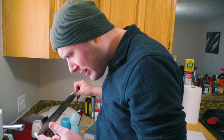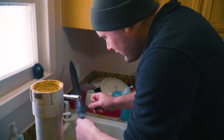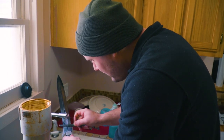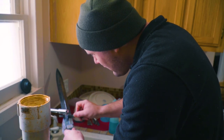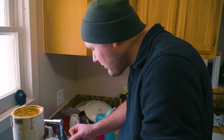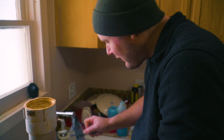Might possibly have a spot or two that's not etching how I want, but it's a little early on. Blade's sanded to 1000 grit, so now every few minutes I'll clean off the oxides from the acid — I'll do that with 1500 grit for a couple of cycles, and then I will do the last couple cycles with 2500 grit. You can go straight to 2500 from the 1000 grit, but I find this just helps make that transition a little bit smoother — at least it does in my mind.